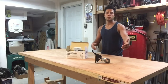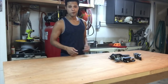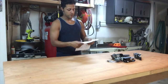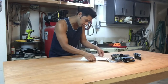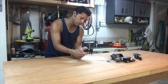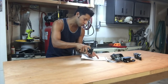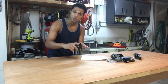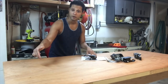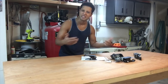There are some measurements to take. I put plates on the legs to make it easier to attach. First, lay out your parts — dump everything on the bench, get the instructions out. Here's the hardware bag: four casters and four plates. The instructions tell you measurements — the plate goes in this direction on the workbench legs. The top hole center has to be four and three-quarters inches up from the bottom of the leg, and the bottom screw hole has to be two inches up. I'll measure with a combination square, mark where I need to drill, maybe clamp them in place.